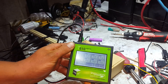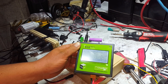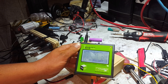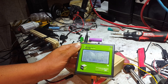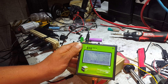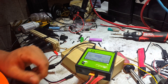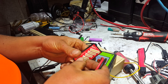It says 'cell count error' — let me try to start that again. I think I might have moved the plug out. Let's check the battery connection. Sounds a bit more happy now — it's pushing half an amp in. Target voltage is 8.4 volts. A little red light at the top flashes to indicate it's charging. There's a warning beeper going off — the balance leads might be a bit unhappy with something.